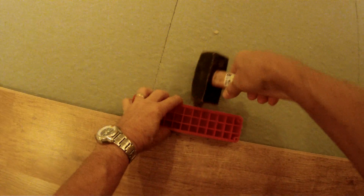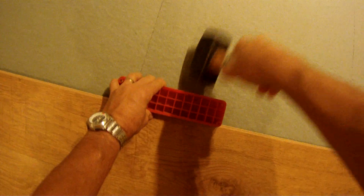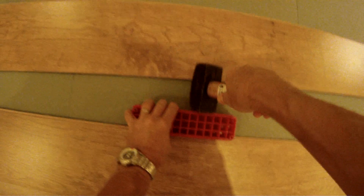Now let's give it a little tap — it helps to stand on this side of the board to stop the rest of the board moving. Get the flat edge and tap it in — near enough at the two-thirds point, middle of the board — see it's already dropped just by the little tap. Keep going all the way along, do it across the join, see how it's dropping as we go — it means it's going into its final position. A heavy hammer like this one comes in useful, so you need a few tools, nothing too expensive. And it certainly saves you a lot of money compared to paying a tradesman. Now there we are, that's the next row fitted — all nice and flat, lovely invisible join.